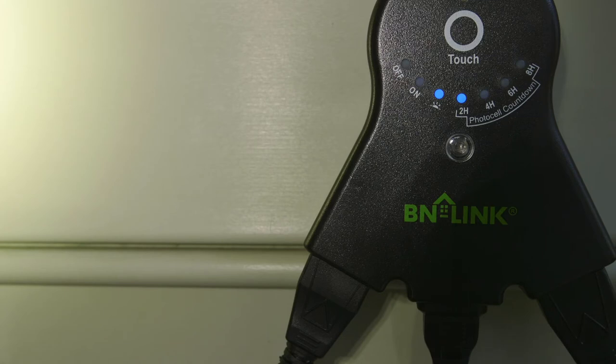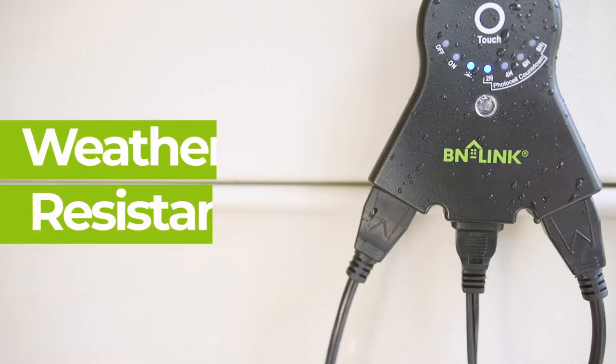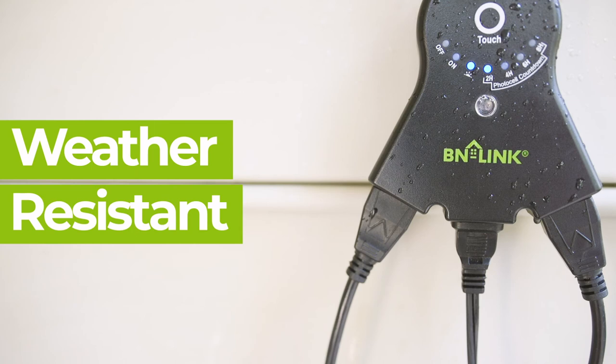If the device does not turn on at dusk in a setting where it should, please check that the timer is located in an area that doesn't have too much ambient light for the photocell to sense darkness. The timer is weather resistant and rated for outdoor use. Please be sure to place the timer somewhere where it can sense daylight.